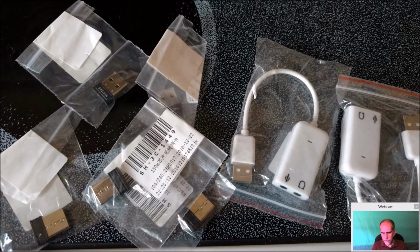And of course, the Pi 2 and 3 have audio that you can tap in and pump out, no problem. The Zero, it's not as easy. If you're using HDMI, you get sound over HDMI. But I needed to do a different route. So I got this little USB audio device. No drivers are needed. You need to just put a small line in.